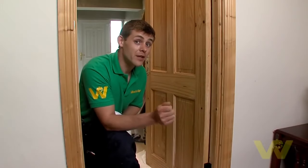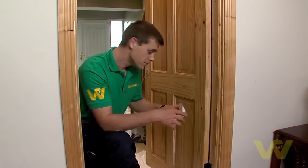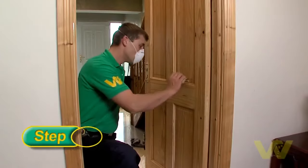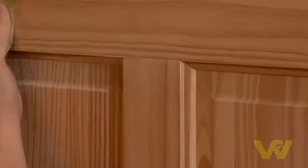If this door had been previously painted or varnished I would have had to wash it down with sugar soap, but as it's a raw door I can go straight into sanding it. Don't forget to put on your mask. If in poor condition, the paint must be stripped back to the bare wood. Begin by sanding down the door using a medium grit sandpaper or sponge. This will remove any blemishes or dirt on the wood and will help the primer to stick to the door and give a better finish. Top tip: when sanding wood, always sand in the direction of the grain.